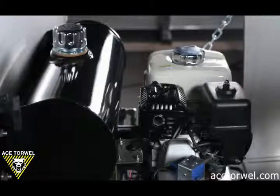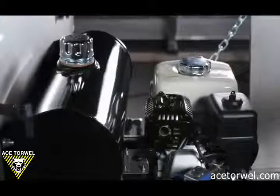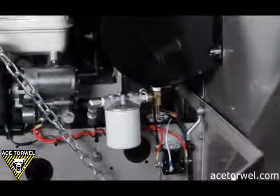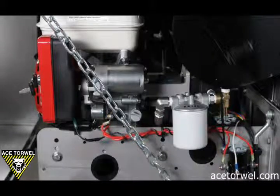One additional feature on the hydraulic system is the frozen or stuck load relief pressure valve. It has a pump installed to the horizontal shaft, which in turn goes into a solenoid block. The block controls the flow of oil to the conveyor motor, to the spinner motor, and then again back to the tank. The frozen material collection system in the block gives us a pressure relief valve so that if something does become lodged in the conveyor, the unit sends the oil to tank rather than trying to spin the conveyor shaft. The unit then should be shut down and whatever's clogged in the conveyor should be removed.